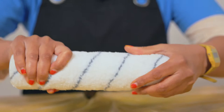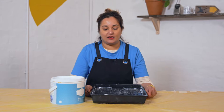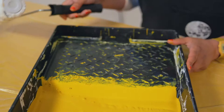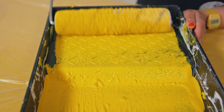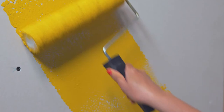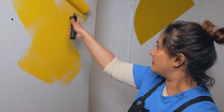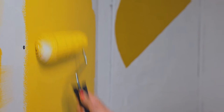Your next step is to get the paint in the tray. Use the deeper end of the tray and simply pour the paint in — not too much, just as much as you need. To get enough paint on your roller, dip it in the paint and then simply drag it over the tray. Do this several times to ensure that your roller has an even coverage of paint. Then simply work across in a criss-cross manner, then side to side, and up and down for a smooth and even coverage.